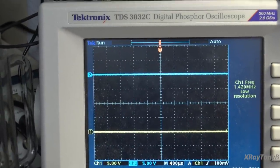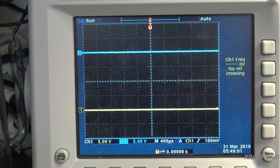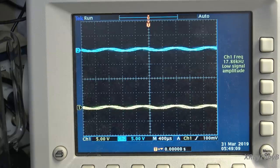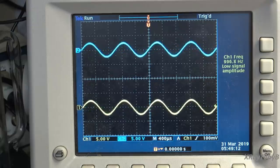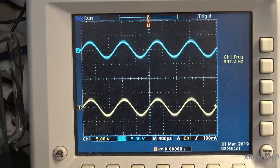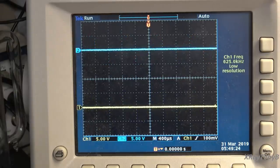Here we go. All right, we ready? She's nice and warmed up. Let's bring it up and let's check for clipping. Remember, we're on 50 volts per division because I'm on my times 10. And we bring this up and look at that. Talk about perfect symmetrical clipping. I mean, good grief. You could set that with a micrometer. It's so accurate. And the amp's running really cool now. So we're going to do some burn-in test on it and check everything out. And then we'll do some other testing.